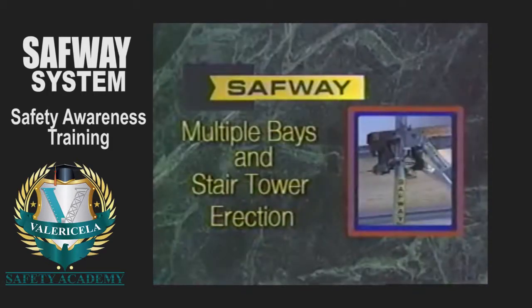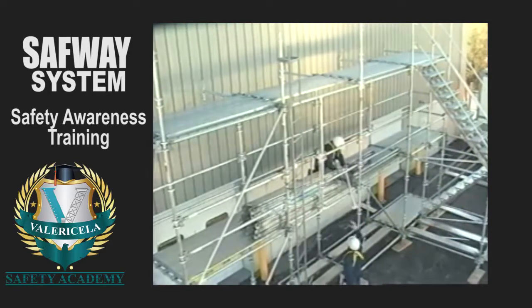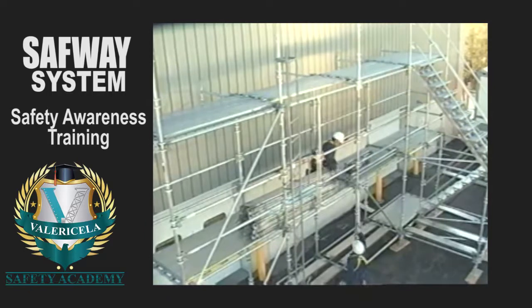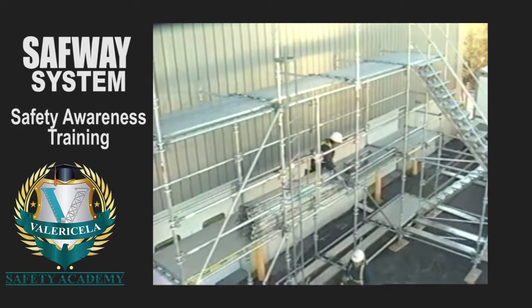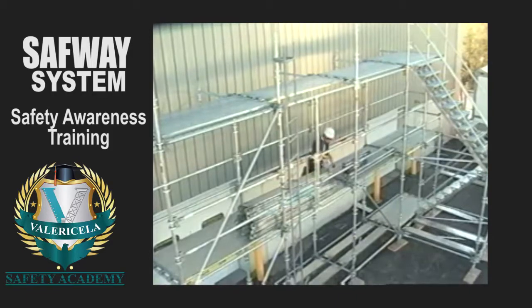Now that you are familiar with SafwaySystem scaffold components and basic erection procedures, let's move into our next topic, multiple bays and stair tower erection. Multiple bay or a run of scaffold bays are easily erected. The same basic procedures using SafwaySystem scaffolding components are repeated. With the base leveled and squared, erectors can move right through.